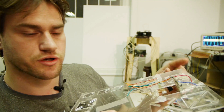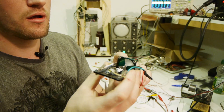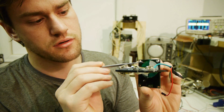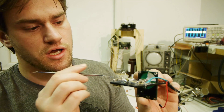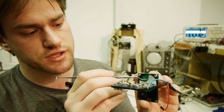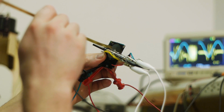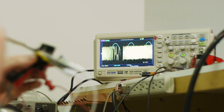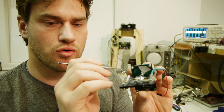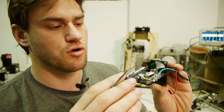Since it worked great, I moved on to making a second revision, and here it is right here. This one has that capacitive feedback foil plate. Capacitance is a function of the distance between this plate and these copper pads. When this rotates, it changes the distance from two of the pads versus the other two pads, and that changing capacitance is what we read to find out the position of our mirror. With that information, we can drive the coil just the right amount to change the position to just where we want. And so that's basically how the Pro is going to work.